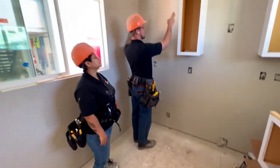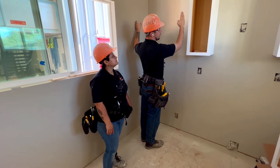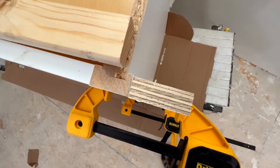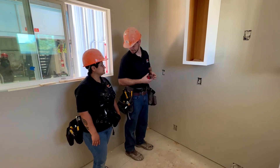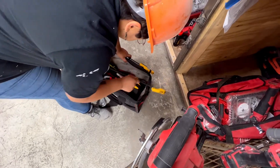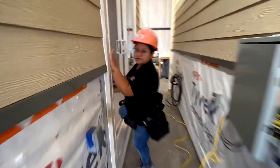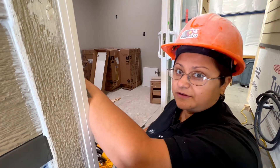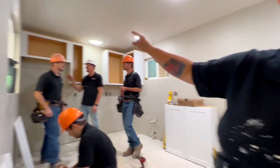In this space there's going to be a little bit of a gap between here and the wall. We take that gap and divide it by two and put the filler boards in here so that hopefully when we're done it looks centered. Going fishing for clamps — we're clamping it down. Right now I'm just checking to see what this group is doing and how their cabinets are looking to get an idea of what we're doing. You can see they have their cabinet up and the two little filler pieces.